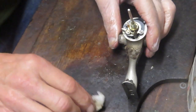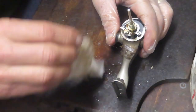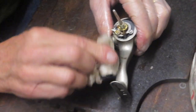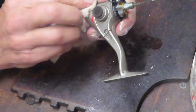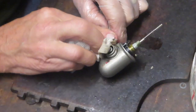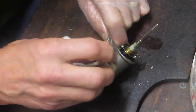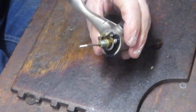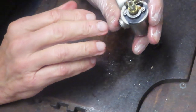That's the servicing of the rotor component. You can see we still have a lot of that dried grease on here — now let's get that off. That's why I wanted to take the rotor off; it makes cleaning a whole lot easier. And then we'll remove the case below. What I'm seeing is a single ball bearing, probably. This is always one of the things I recommend: if you don't know the reel, take pictures along the way so you can learn about it.